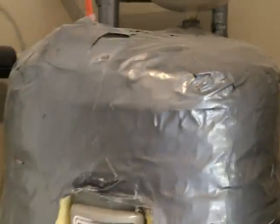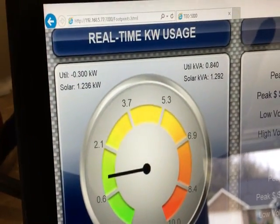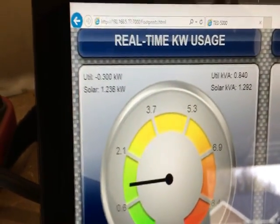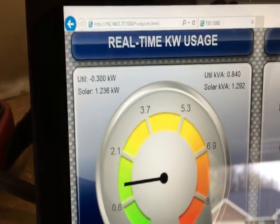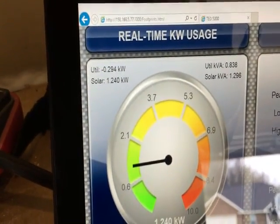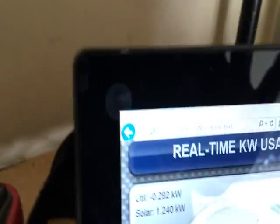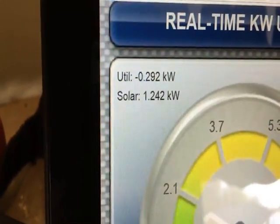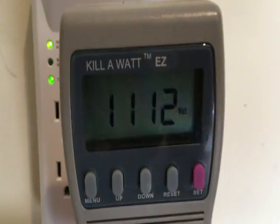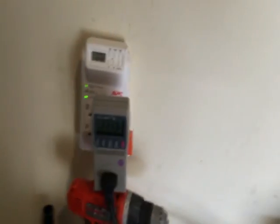Anyway YouTube, I'll keep you informed — everything is good to go at 1.2 kilowatts. My freezer just kicked in, so I'm buying 300 watts from the utility, which is fine. But I'm still utilizing over 1100 watts from solar. So 1.2 kilowatts in versus 1.1 kilowatts used — that hot water tank is being heated with solar. Take care!